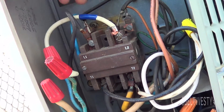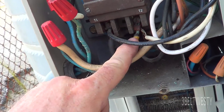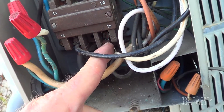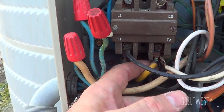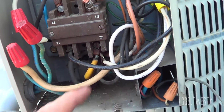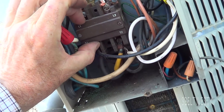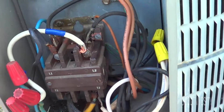This is the input — there's a hot here, a hot here, and the third hot goes onto the high leg. You can see this one here has gotten hot, and what it does is it tends to get kind of screwy looking, the plastic gets brittle, and with the corrosion and heat it tends to loosen up and get really hot and generally just breaks off. When it's running you can take a voltmeter and go across this to check for voltage drop — sometimes that's a giveaway you've got a problem. This contactor is pretty old, I probably should replace the whole thing.